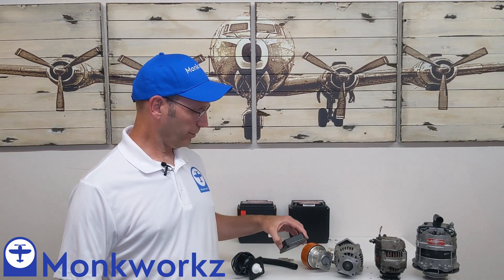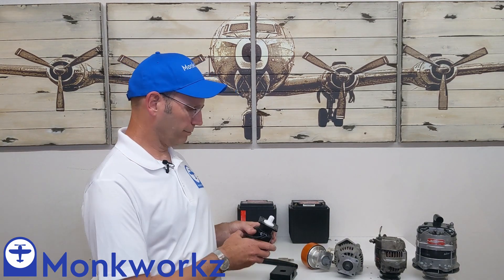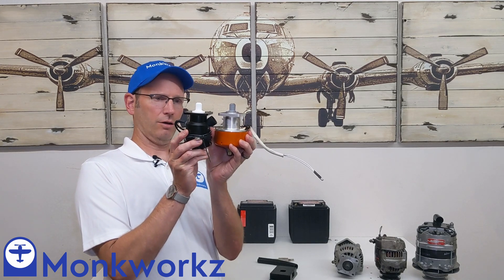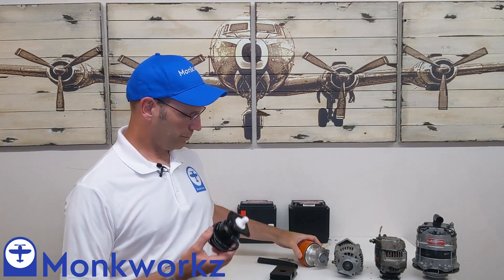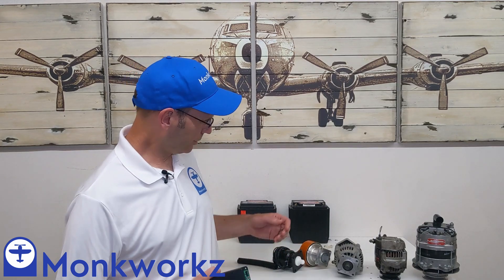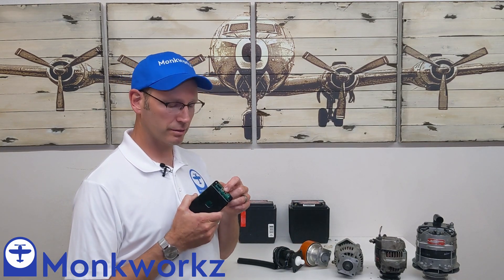With that come a host of other advantages too. You get a compact design. I've redesigned the shear coupling, and you get a much more compact profile off the face of the vacuum pad — I picked up about an inch of space there. Mechanically the thing is more compact. From an electrical perspective, I used to have a large ANL fuse on my firewall. I was able to get rid of that for a tiny fuse on here that's about the size of a grain of rice.